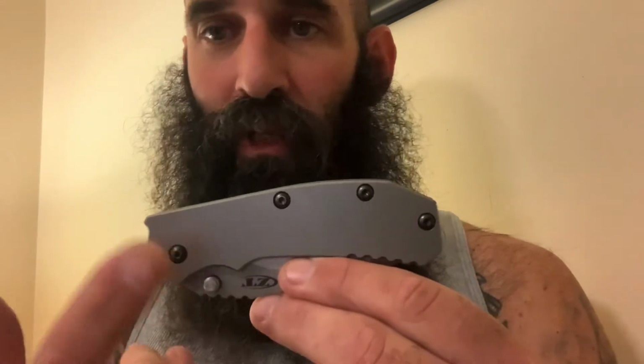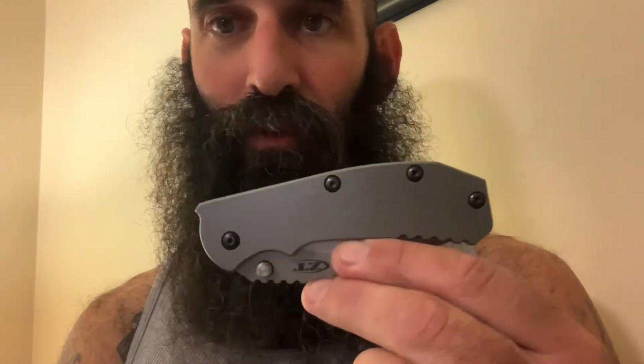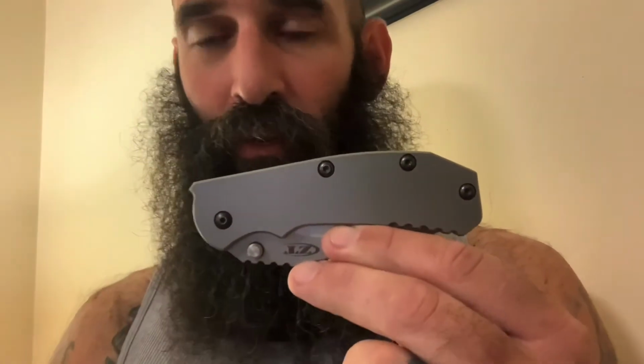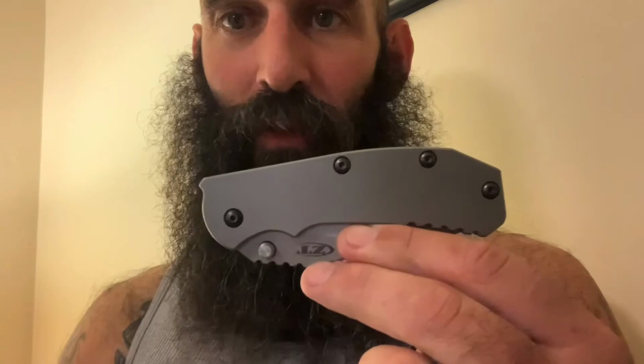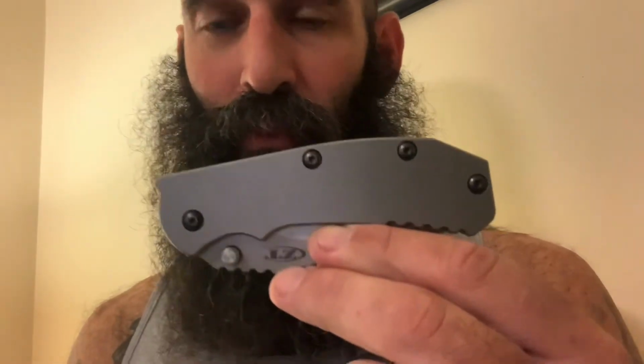I didn't drill the counterbores. I didn't drill the holes. I just interpolated the whole thing, circular, helical interpolation, all the way down. Just did basically the whole job with 3 tools. So super easy setup. No, it wasn't hard at all.